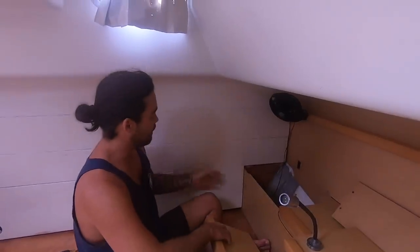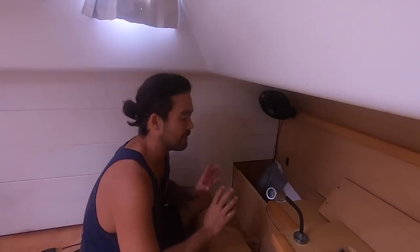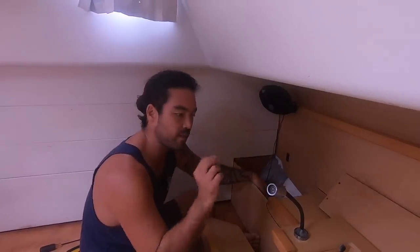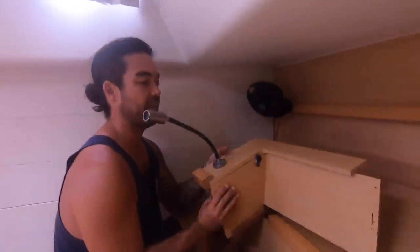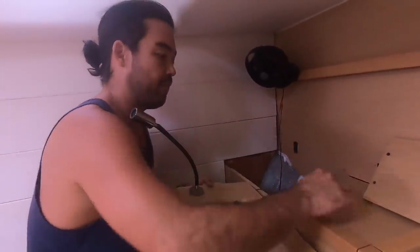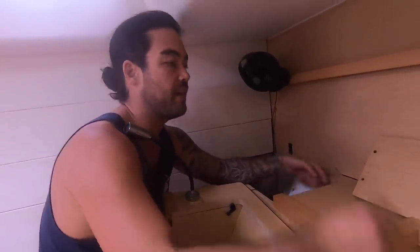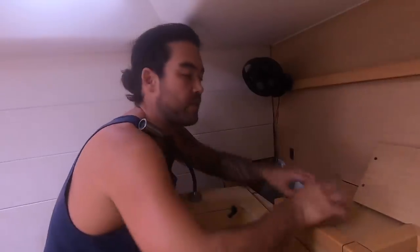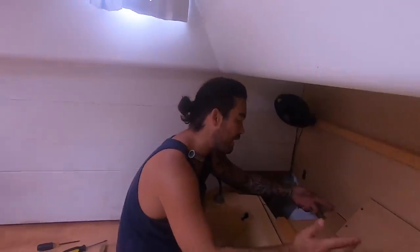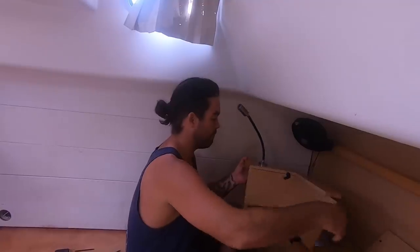We've just put these white panels back on. Hopefully there are only one or two cuts that will be visible and we'll put a couple of battens or maybe a bit of cord over them. We made a sacrificial cut straight through there — unfortunately there was no other place. This panel is connected from the back side so there was no way it would come up. We had to cut it somewhere, so we cut it in the narrowest part.